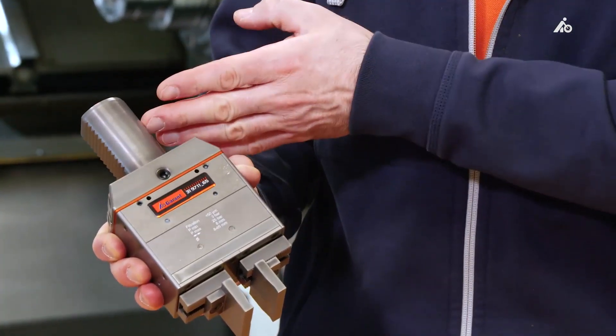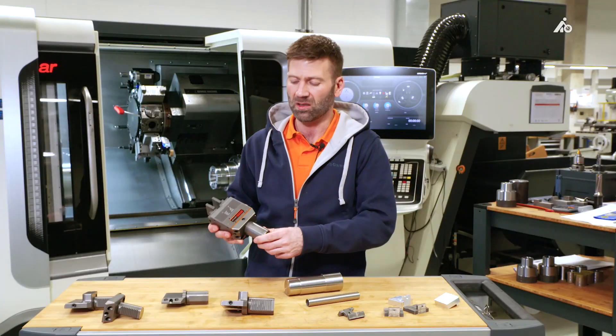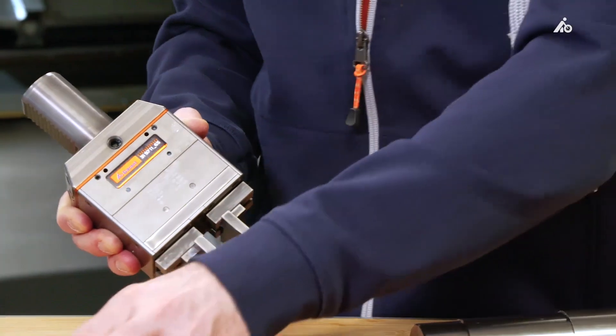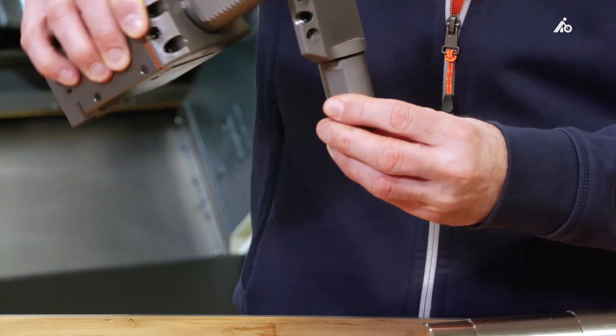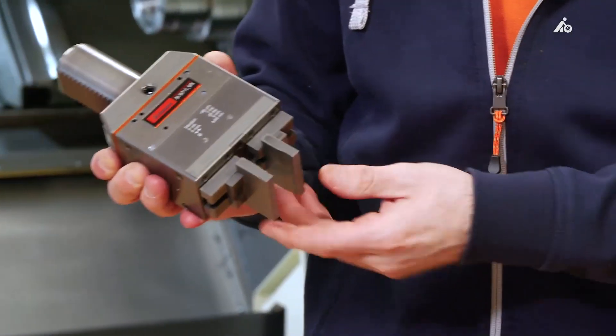The interface to the machine has also been designed to be adaptive, so that I can screw mount different shanks for VDI 30, VDI 40, but also cylindrical and cranked shank designs. This means the bar gripper can be used in a flexible way both on disc and star turrets.